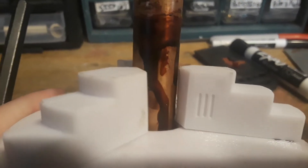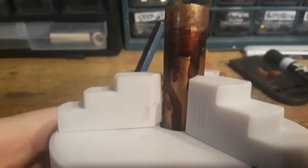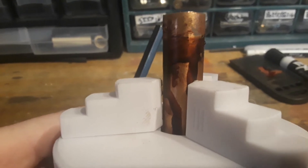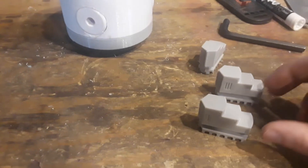There seems to be that little gap right there. Let me turn off the light and see if you can get a better view. You can see it right there — see that little gap. What that does is it doesn't give us the maximum amount of surface area of grip that we can have on our workpiece. That's the main problem with these jaws that come stock with the chuck.